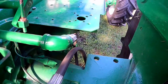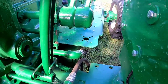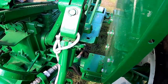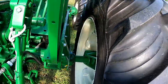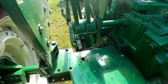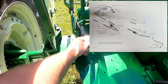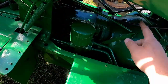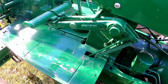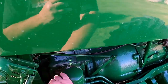So you don't really have to worry about the fender tanks — your gauge just stays full until they're empty. On gasoline-powered tractors there was a selector valve right here. People often ask what that hole is for in the back of the platform. Both fender tanks and the main tank up front came into that selector valve, and they all worked off gravity. So you'd select your fender tanks, keep an eye on them with the dipstick, and when they were getting low you'd just switch the valve to your main tank instead of using vacuum. I'm guessing they didn't like the idea of putting a vacuum on a gas tank, even though pretty much every car does it now.